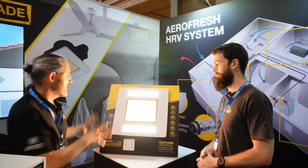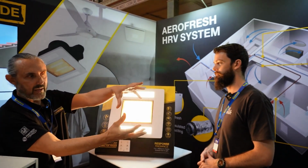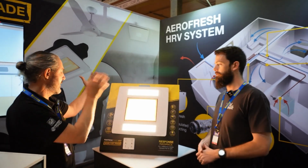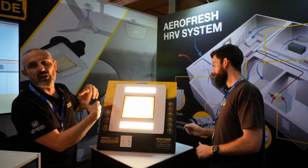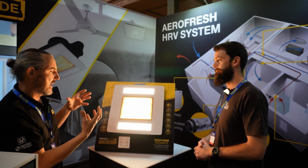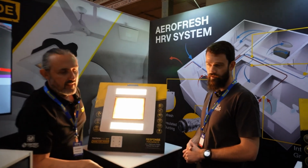Yeah, so this is a nice airtight module, and in fact, it's the same standard bathroom exhaust fan with just a different grill on it. So in the back of it, which is a little bit hard to see, we've got a nice sealed box which has a backdraft damper in it, so you actually get a reasonably airtight structure for that sort of 3-in-1. Very cool. What else have we got here, mate?